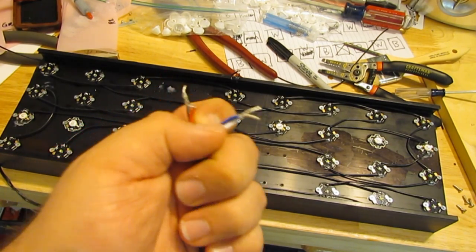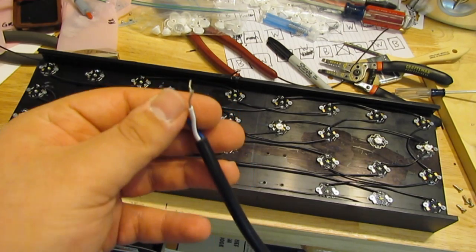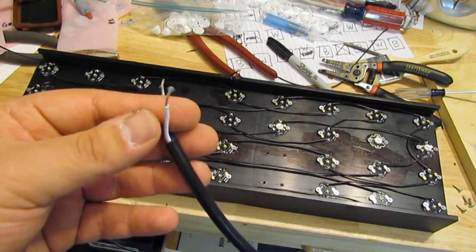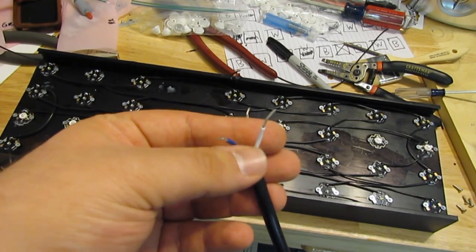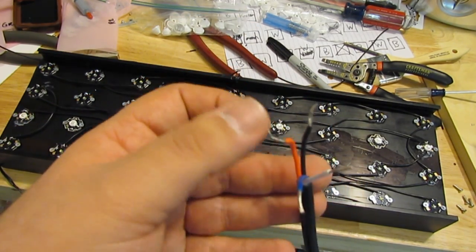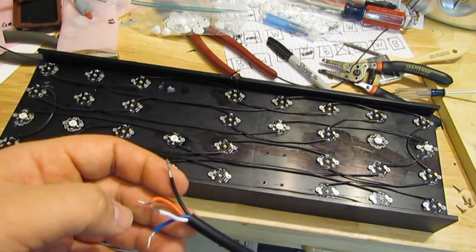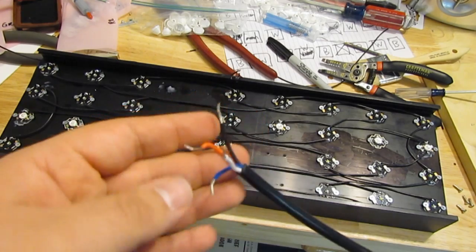On the DC output side of the driver you have the dimmer wires and the positive and negative wires that go to the LEDs. Connect your dimmer switch — if you have a potentiometer, take it all the way to max, 100%. I'm not using a potentiometer so I'm going straight to the 10-volt DC adapter for testing. The red wire goes to the positive end of your first LED and the black one goes to the negative end of your last LED. Since I have 12 LEDs on that string, I'll hook the red to the first and the black to the 12th.